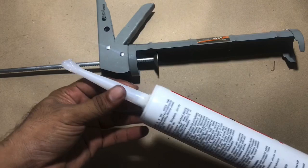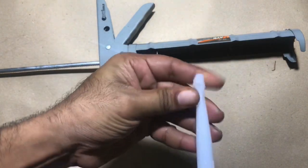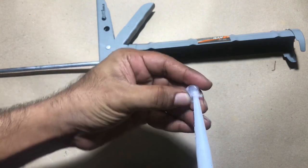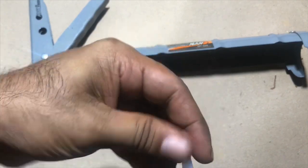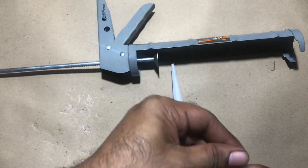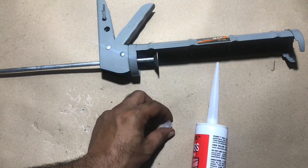This dry protection cap will protect the silicon sealant from drying faster and makes it easy to reuse. Now I am going to show you how to remove the cap after 4 days. The outer surface of the cap is completely dried. Hold the cap and pull back very slowly and carefully. As you pull back, you will see how deep it got dried inside the nozzle. Remove the dried part from inside the nozzle very slowly and carefully, because if it breaks inside it will be very difficult to remove — you may need a small wire to get the broken piece out.